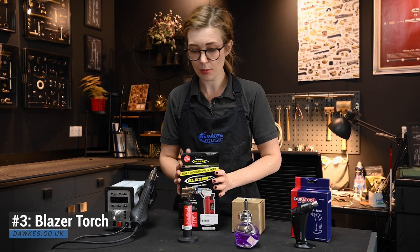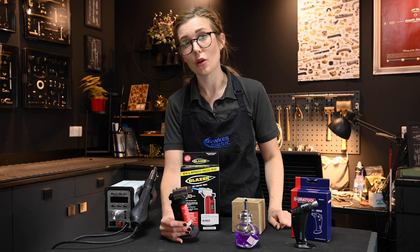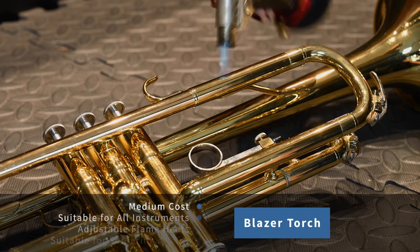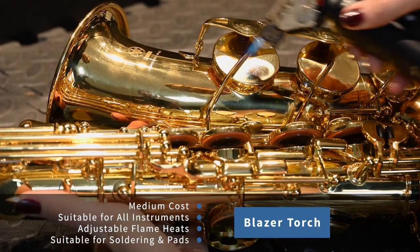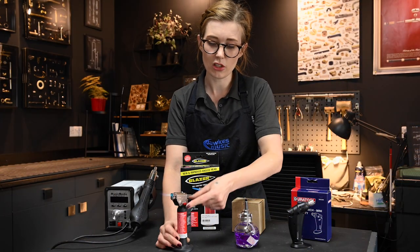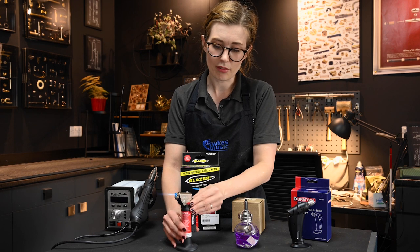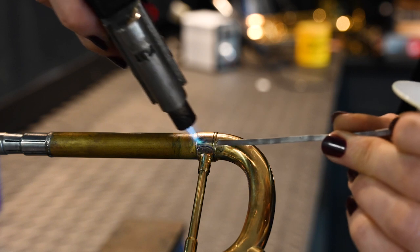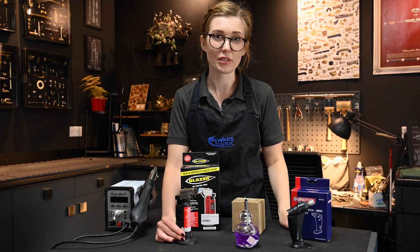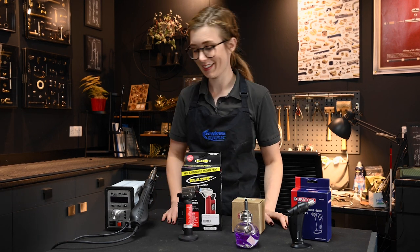The one we use the most is the next one up: the Blazer ES1000, called the angle head torch — also just known as the Blazer torch, as it's very popular in the trade. It's small and handy, not much larger than the mini gas torch, but it has a lot more uses. It has a base you can stand safely on, works on butane, and also locks on. The difference is it has a lot more movement and options for the flame — this is the one I'd recommend for soldering work and high heat jobs. It's the only one that can really do soldering well. This one is about £90 at the moment, and the whole workshop uses it.